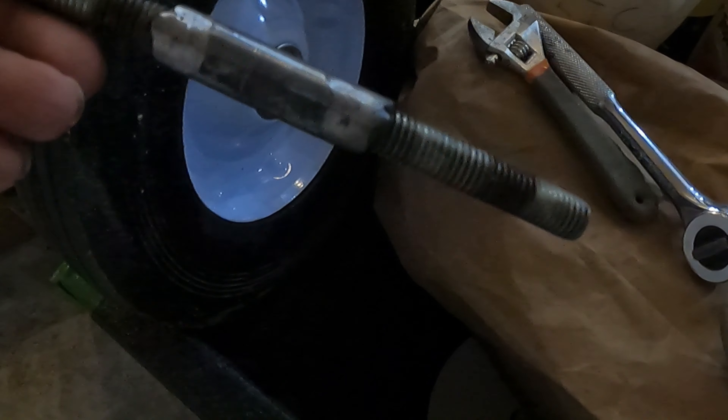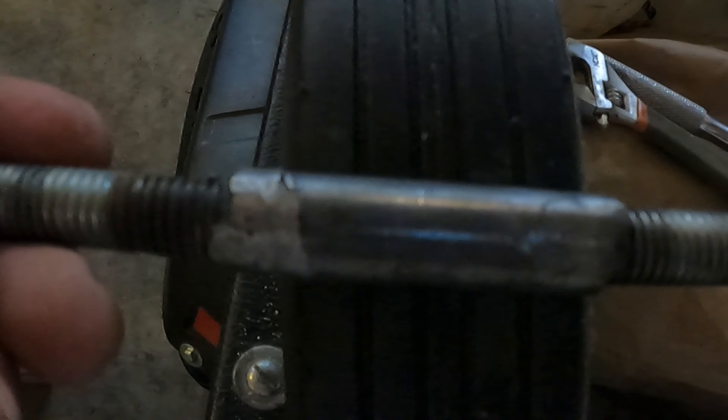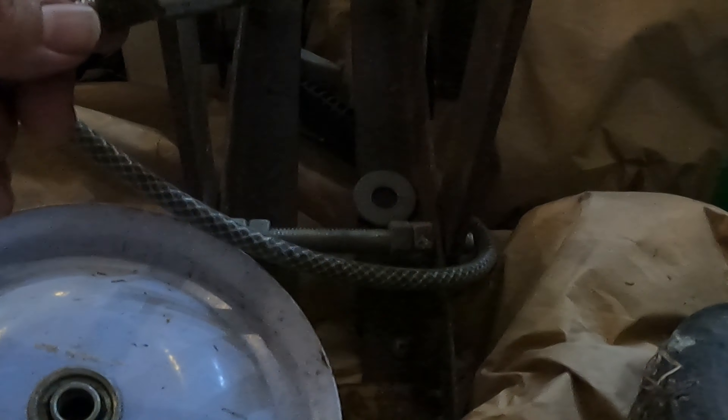All right, I got my axle welded up. The total width of my brackets is about seven inches, and the width of this wheel where the axle goes in is two inches, so that left me five inches divided by two — two and a half inches of threaded rod on each side. But I already can't get it in there, so the solution is going to require me to grind off the welds on one side at least, get it all together, and then start welding things back together. I'll probably do that in the morning.